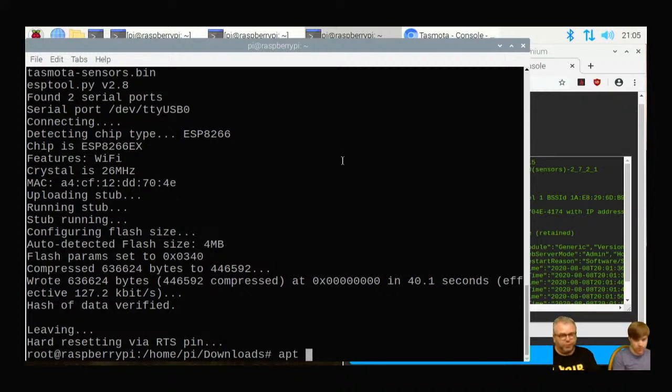Yeah. So Jeroen is asking, hang on, you're using a Pi and an ESP, why not only an ESP? So Crazy is already telling that the broker is running on the Pi. So we installed MQTT before, and that's a broker. What you can do is make the ESP send all the sensor data to the broker, to the MQTT server, and all the devices that are subscribed to it, and it could be an Alexa, or a screen, or a website, could all benefit from its data.